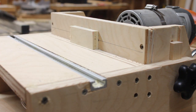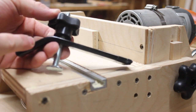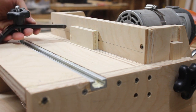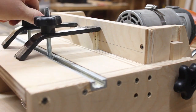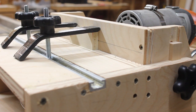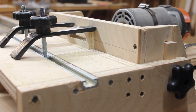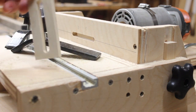I might as well mention — I made these toggle clamps, and all they are is a piece of quarter by one inch aluminum flat bar where I put a little bend in, with a t-bolt and a thumb nut. I already took the time to set my stop blocks. I want a slot that measures two and a quarter inches long, so I just set each block at an inch and an eighth and I should be good to cut my slot. Looks good.